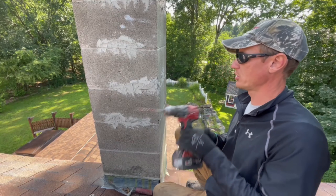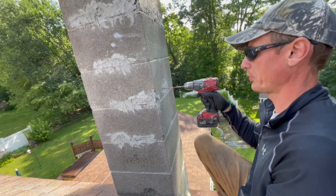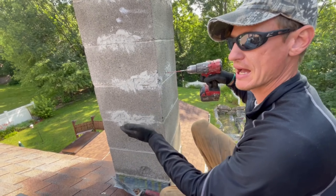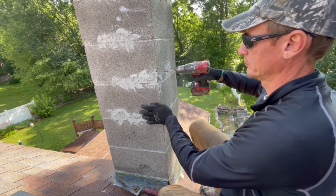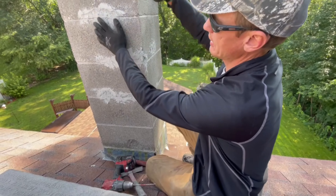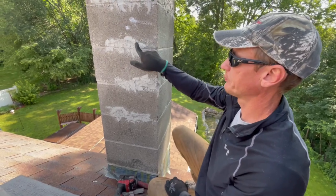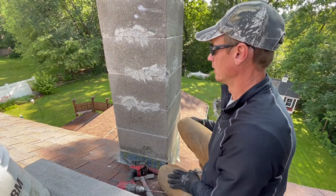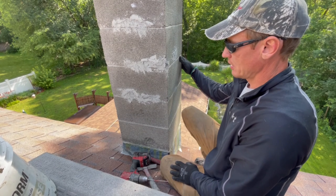We're going to be repairing this block anyway, so I've got a hammer drill. You can drill a hole through and see if you find one of those pockets — if the drill suddenly slips in real fast, you know you're into one of the pockets. Did you see it? The drill just gave out — I'm into one of those pockets. Those pockets hold water, and the water fills up at the bottom trying to get out but can't because the mortar joint won't let it drain. This is a problem with modern mortars — they don't want to drain.